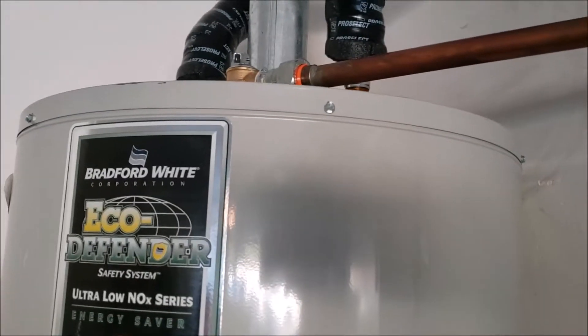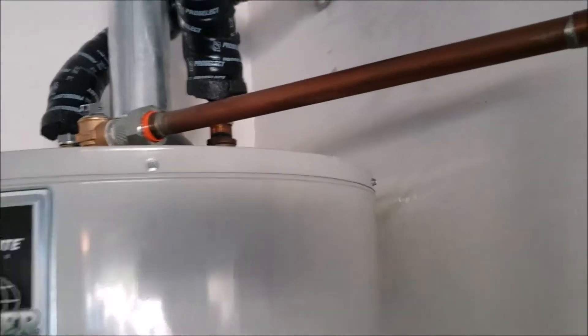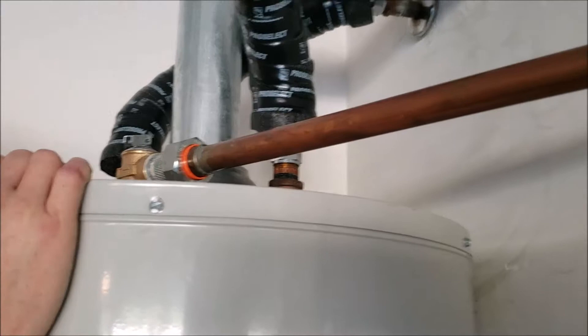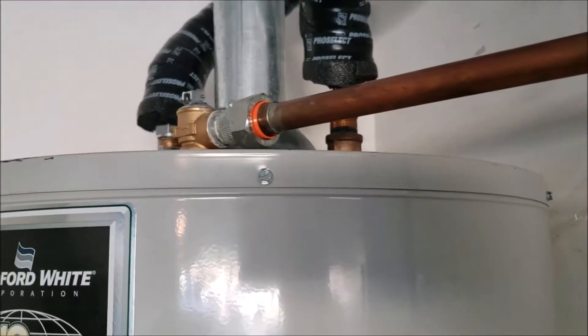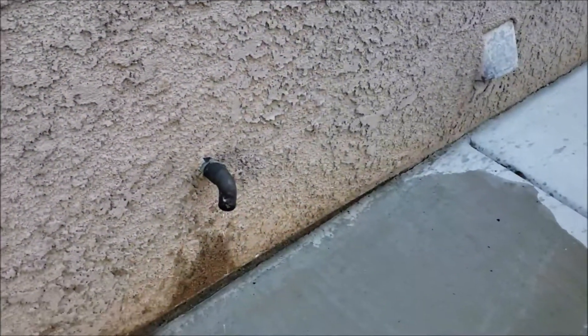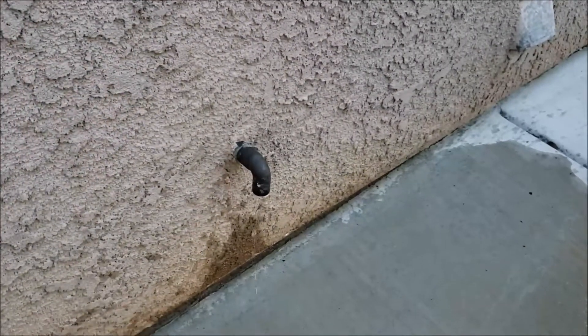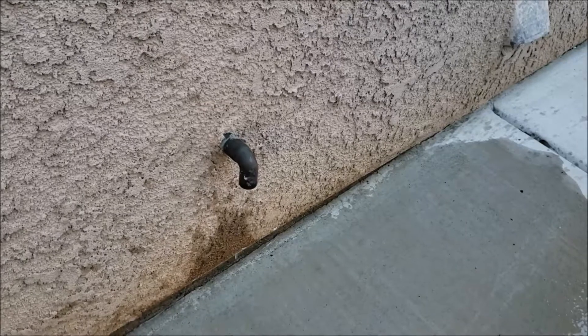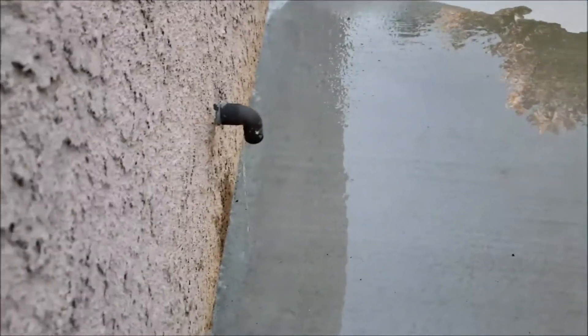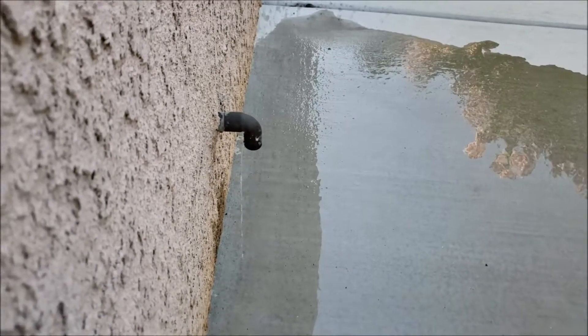While we were doing this, the tank is now full. We closed that relief valve because water was draining outside the building. Hop back up there, activate it one more time, and let it pop down by itself. You'll hear a very loud knocking — that means the spring is seating correctly. When it comes down and hammers like that, you know it's closed. Outside, this is where it drains down — the relief valve activates on too much temperature or too much pressure. This should never have water coming out of it passively; if it does, give us a call.